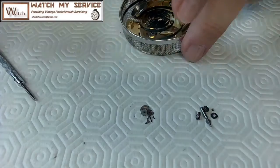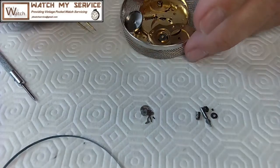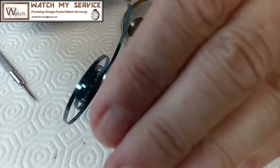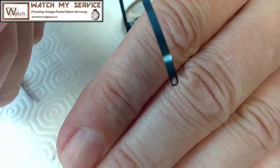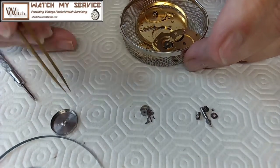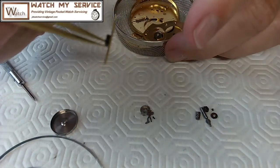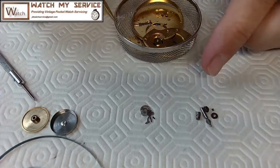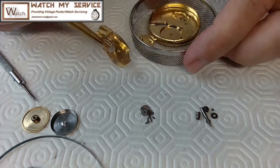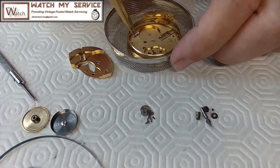The next thing I need is the plate, so I'll take the spring out here very carefully. This spring is nicely cleaned up — I like it because it's got a notch on it so I don't have to deal with that T-brace. That's the mainspring. There's the cap part and the gear, and there's the arbor. I can see it right down here, so I'll put that back in after.